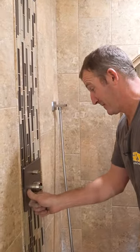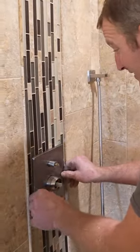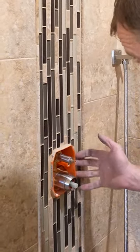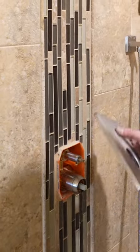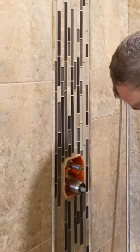That's kind of cheap. There's a lot of situations where that wouldn't work out very well, but I'm going to end up probably just silicone-ing this. I'm not really overly concerned because this is obviously completely watertight. That's one nice thing about this box. I have the waterproofing seal there and I got this grout all the way around here, so nothing's really going to get into this. It's just, you wouldn't really want water getting behind the escutcheon plate.